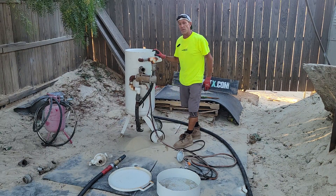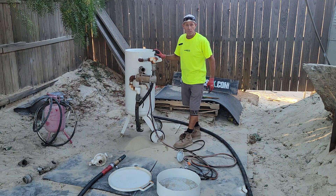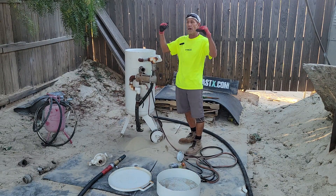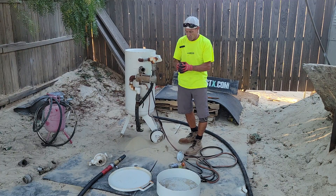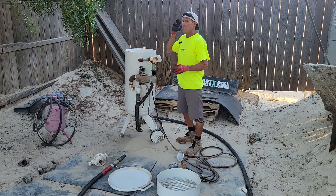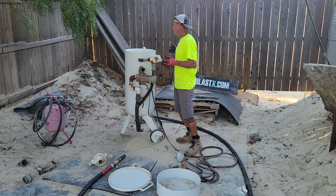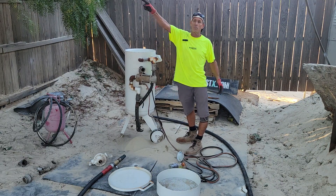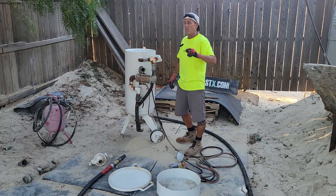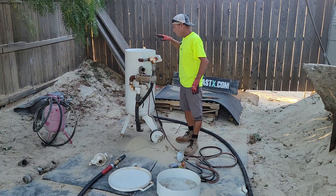You want to get dry sand. Home Depot, Lowe's, building material stores have it. Tell them you're doing sandblasting. Some states like Texas they've got some special black stuff — I don't know what it is, but cool stuff. Anyway, it has to be dry, it has to be able to flow to a cone. If you drill a hole and it all flows through, you can probably sandblast with it. I personally get my material at Larry's in Corona — been going there 20 years.